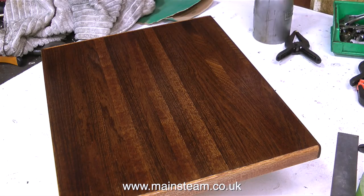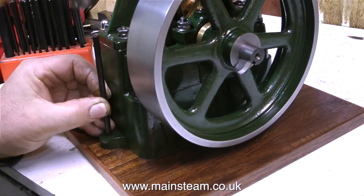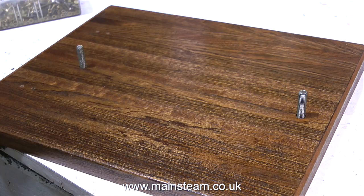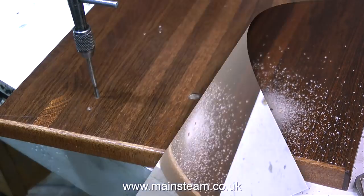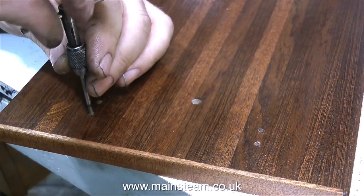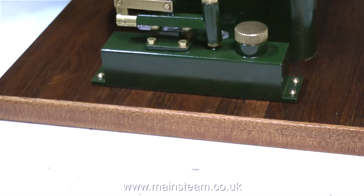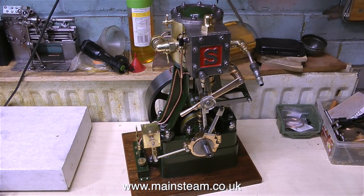24 hours have elapsed since I put the varnish on this board and now it's fully dry, so I can mount the engine in place with the small oil tank at the side of it. To accurately mark out the hole positions from the engine onto the board, I'm using things called transfer punches — again, very cheap from the auction site. I drilled the holes for the bolts, threaded the holes with a 6BA tap, then mounted the engine on the board using lock nuts. Then I mounted the oil tank at the side of the engine. The engine and oil tank are now mounted to the baseboard and it looks okay — far better than just screwing it to a piece of plywood, and in my opinion better than putting it on a mahogany plinth. This is the Stuart 5A that I rebuilt, and I think it looks quite good sat on the plank base.